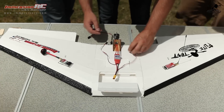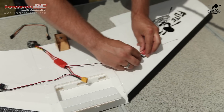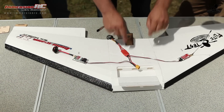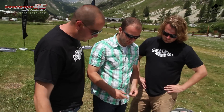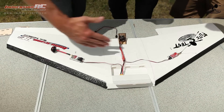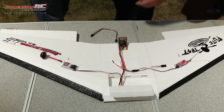What's next? Basically, you hook this in — this is your power for your video transmitter. This stays here and this little signal and power wire for the receiver goes in here, so this is now configured. The only thing left is to hook up the servos. This one moves back and goes in here, and for this one you just need a short servo extension cable. With a 5.8GHz setup, this is plenty of distance between the two for really good performance — you don't have to go wing tip to wing tip.